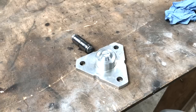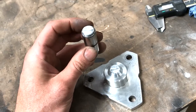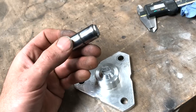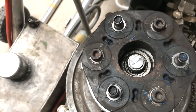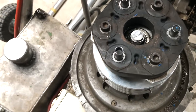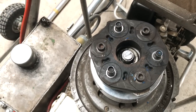The option now is to make it out of steel — that's going to be my choice. This is 15mm diameter and these are ball races and needle rollers, so it's the smallest bearing I could fit inside the clutch housing. You can see the needle rollers in there. That drops inside and that was the biggest shaft I could get into the center of that clutch, so really without redesigning the whole clutch I'm not sure what I can do redesign-wise, but I can make the part out of steel and hopefully that will be okay.